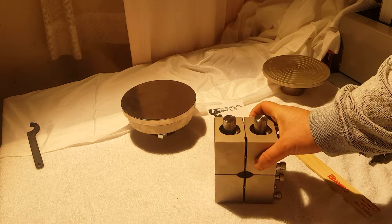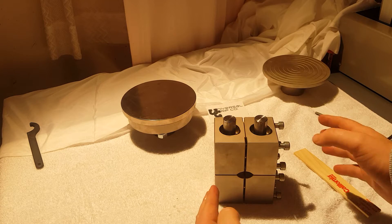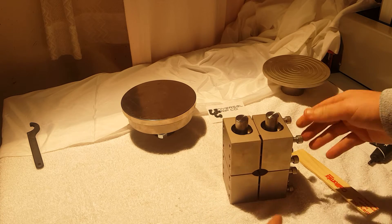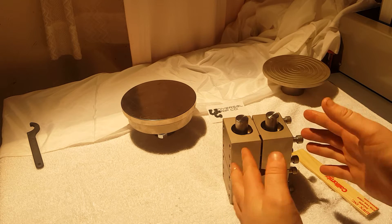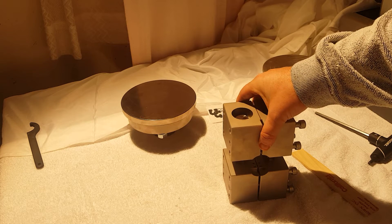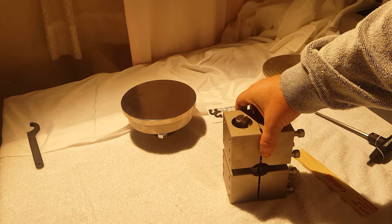It has four pieces, four different quadrants. The pieces on the side are tightened with screws, which compresses the sample laterally. The sample is set in, we load it in compression, and then the sample is compressed and driven to failure.